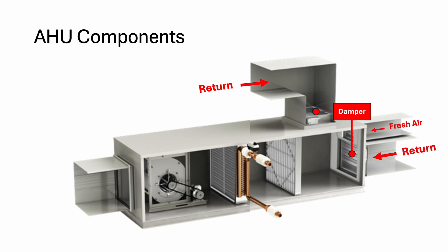You'll notice there is a damper on all these inlets. The damper can be at the AHU or at the duct. We need something to balance the air and control the volume. We don't want one duct to suck too much and another too little or fresh air too much. This damper allows us to control — we can use a manual one or an automated one. If automated, we need some sort of programming and sensor to control how much to open. Then after that, this entire space is called the mixing box or mixing chamber. Return from path one, path two, and the fresh air all come together here, mix, and become the mixed air.